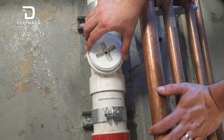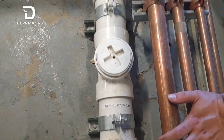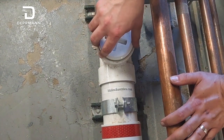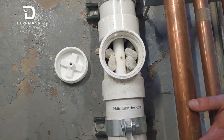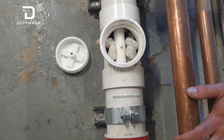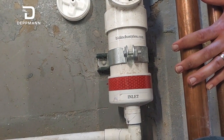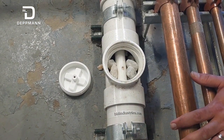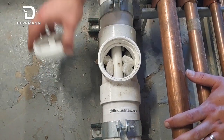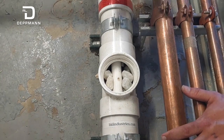After cleaning the trap, most boilers — especially in Michigan — it's code to have an acid neutralizer. This brand from BKI Industries is basically a holding tank with specific limestone rocks that neutralize the acidic condensate before it goes down a drain. Generally you'd spray it down with Simple Green if the rocks are slimy, or you could cut it out, bring it to a slop sink, empty and refill it with brand new rocks. Just make sure it's not slimy, building up water, or backing up. You can clean it and top off with new filler material.